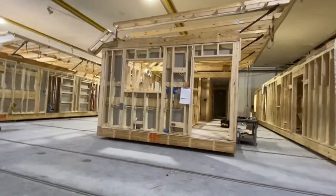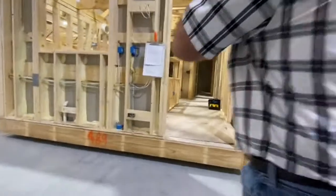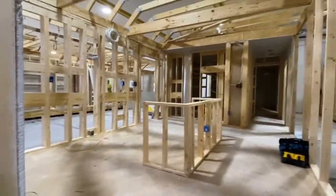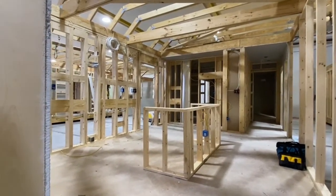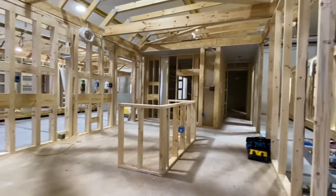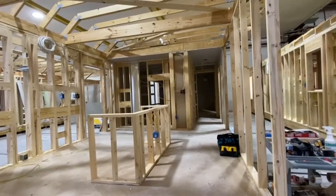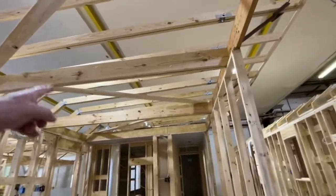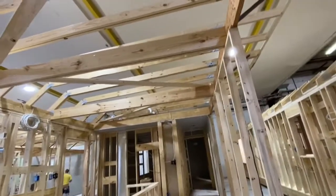And the mechanical, let's see what else is this. Oh, this is called a chalet, so this will have an 8/12 vaulted ceiling on it. That beam structure will stay in here. This will all be open ceiling above here. That'll be wrapped. Those 2x10s get all wrapped on site and then the ceiling is finished.